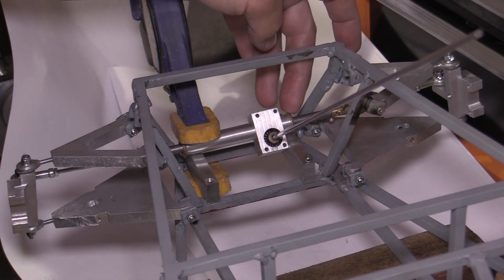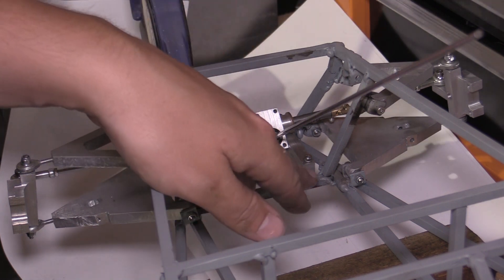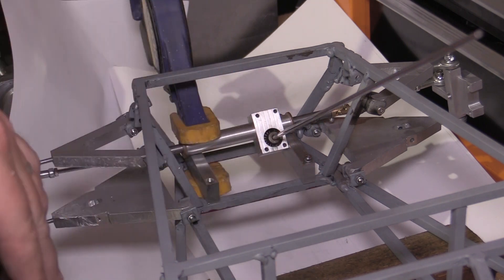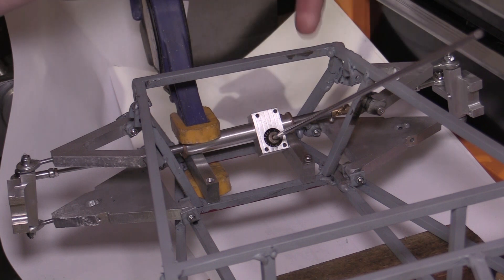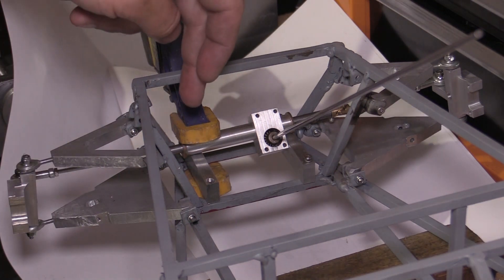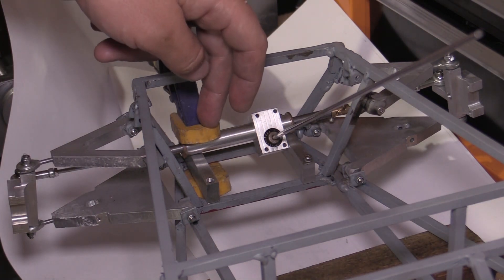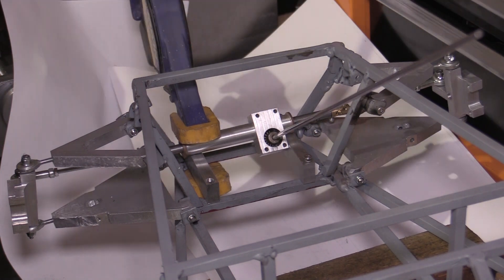The bronze bush in the end of the rack casing is sitting on top of that support when it should sit over the other side - that's just because this material is slightly over thickness, so I'll machine that out. I'm going to mark where the holes need to go, then we can make the clamps and get them fixed into position. I'll probably make the clamps first actually, and then I can put them in position and mark through.